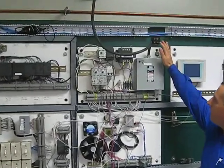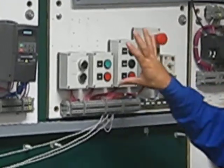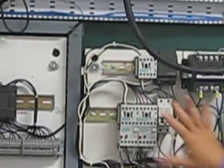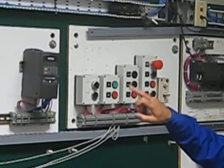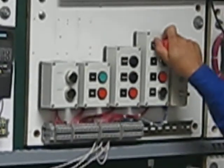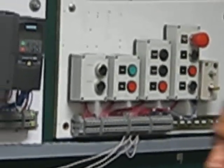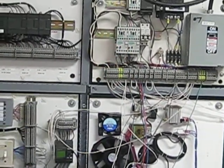We're going to start by turning on the safety switch — I'm turning it on now as you can see. Then I'm going to start the control circuit. For safety, I'm going to turn my contactor on — you can see that the contactor kicks in to control the control circuit and protect it. There are a couple of fuses and other voltage components here. I can start or stop my control circuit from right here, and I can also kill it from an emergency standpoint since this is a maintained switch.